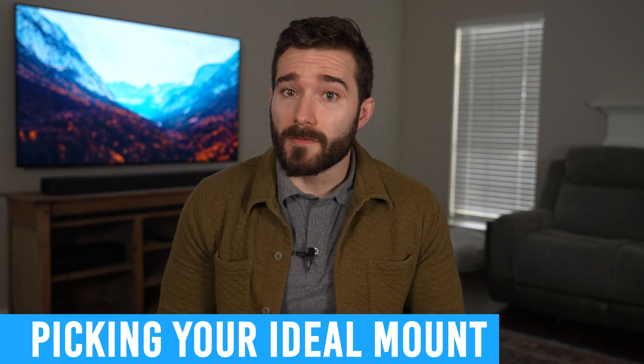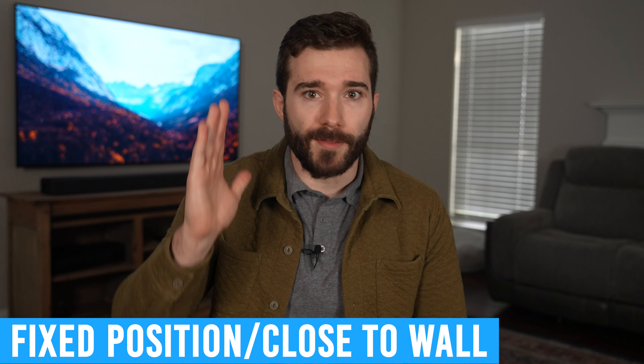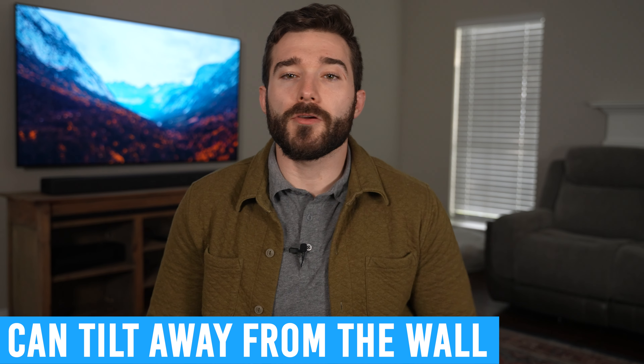The next major thing to consider is the type of mount that you want to use. There are four main types of mounts, and each one has a slightly different use case, and your personal preferences can play in here as well. The first is flat or fixed mounts — these offer no angle adjustments and the TV screen is parallel with the wall. This gets the TV the closest to the wall and is best to use when you can position the TV at the ideal height, which is where the center of the screen is close to eye level when sitting down. The second type is a tilt mount. These allow you to tilt the screen down if the TV is positioned higher than what's ideal, and you can usually tilt them up as well, which can make it easier to connect or disconnect cables. You'll usually use these on a bedroom wall or when putting a TV above a fireplace.